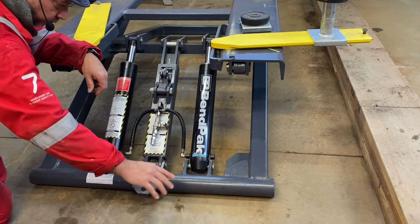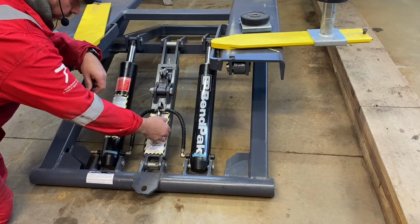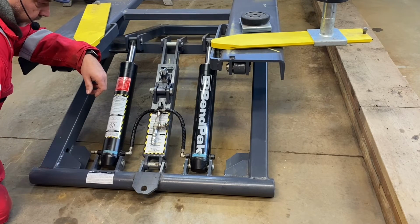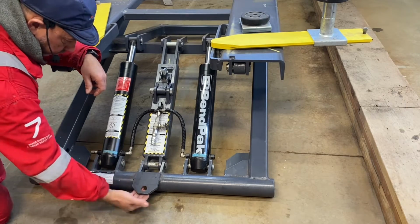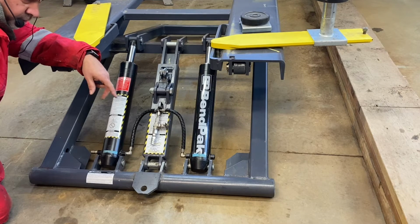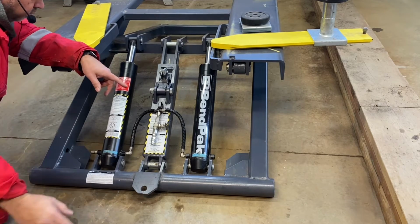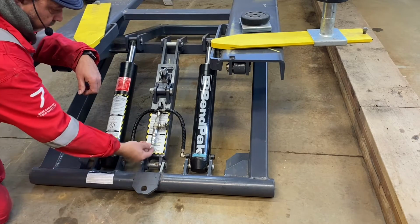So when I take my hydraulic hose, I plug it in here, I turn that valve to open, and now I can operate the lift up and down. I find that much easier rather than the hose attached all the time. Your pivot point is here, which you're trying to move, and your hose is around this front area, so it just gets more difficult. Plus, with the HPU or the control unit further away, you're limited in the length of hose. So when you disconnect the hose, you can move it separately. Much easier to plug it back in.